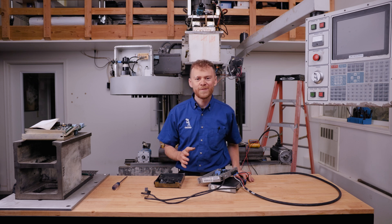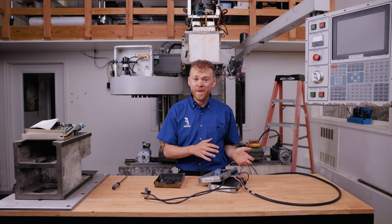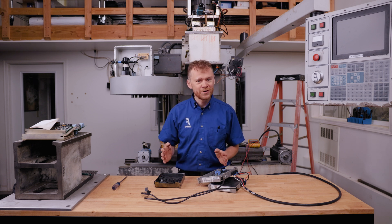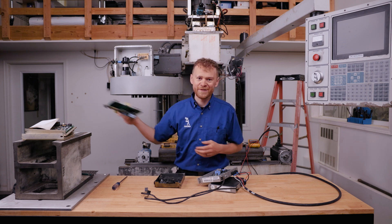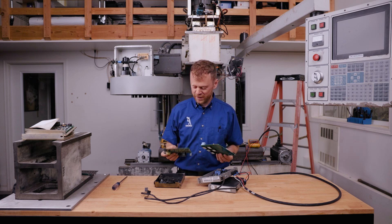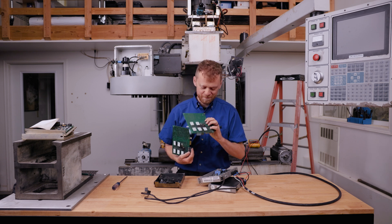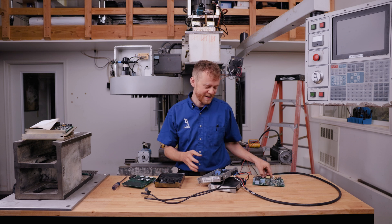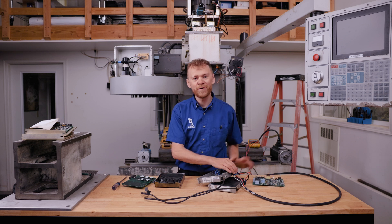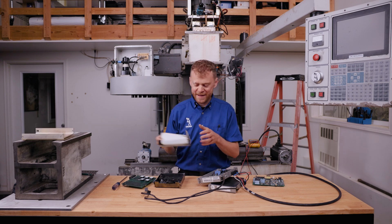What type of alarm you have affects whether you need to go to the back of the machine, pull the wires out, ohm everything out, or if you could just do what they call swapping an amplifier. If you swap an amplifier on a bad motor or cable, you'll blow it up. I've had a customer do it three times — he didn't understand how to measure the resistance of the motor and he had a shorted cable.